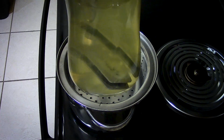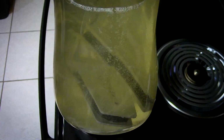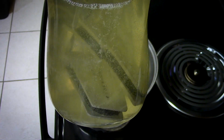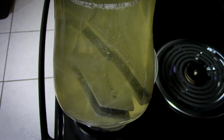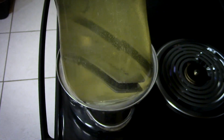Here we can see I'm using a vacuum pump for bleeding automotive brakes. And I use a ball mason jar, submerge the pickups in the molten wax and draw it down under vacuum. And it's actually sucking air out of the windings.